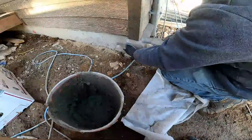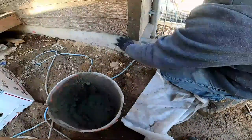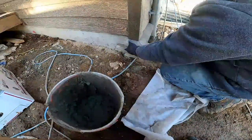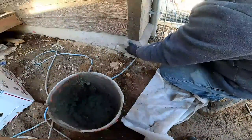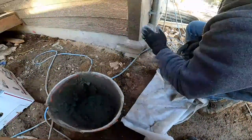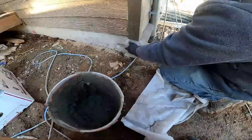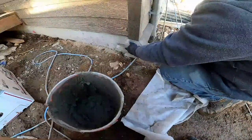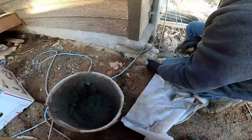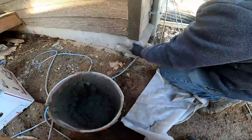If you look at it and you're touching at the top after you're all lined up and everything here, if you're touching at the top and it's gapping at the bottom, you just trim up barely. Sometimes it's hard to tell what's going on because you're dealing with a compound angle. These are slanted this way and on a 45 going that way, so your quickie saw or cutoff saw, whatever you're using, will cut it a little different than the angle you need sometimes. So those need trim just barely, about a blade width.